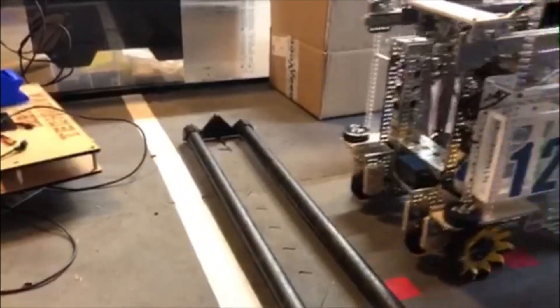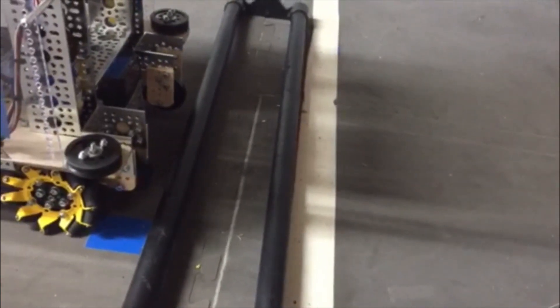They normally aren't touching the ground, but when the robot hits the barrier, the bumper wheels lift the robot higher so it is easier for the bottom of the drive wheels to push the robot over. This solution implements elements of the tank treads and allows the robot to cross the barrier while avoiding the disadvantages of tank designs.